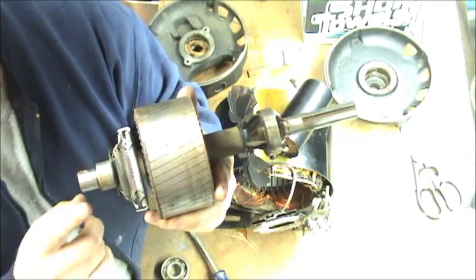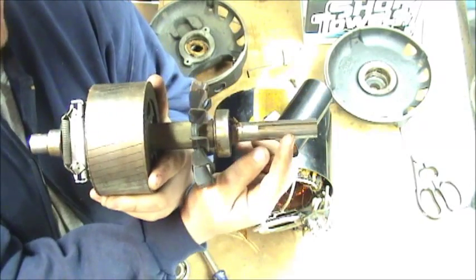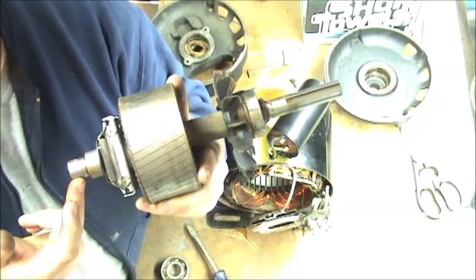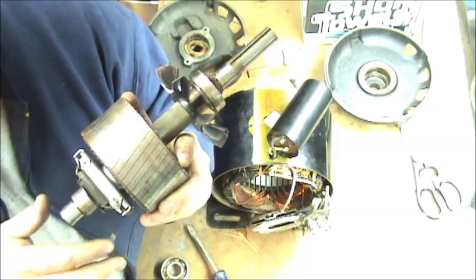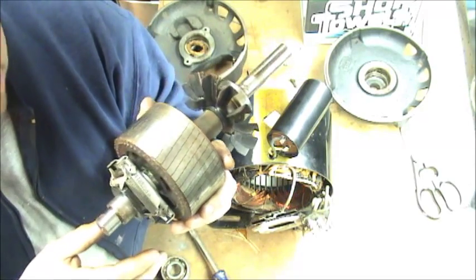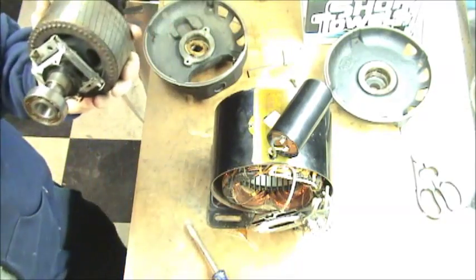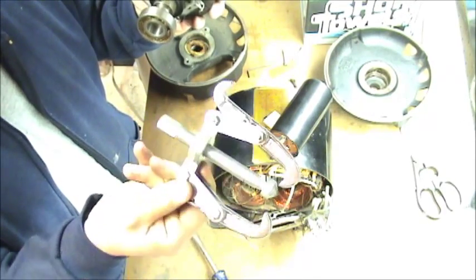Here's the one on the front still there, and here's the one on the back — they're different sizes. It's a three-quarter inch shaft on the front bearing, but this one on the back is actually a little bit bigger. Just so you know if you ever have to buy the bearings themselves, I was able to get it off with a standard jaw puller.